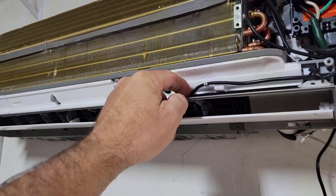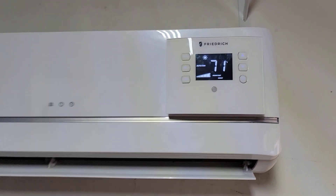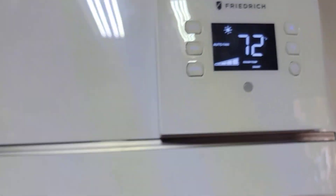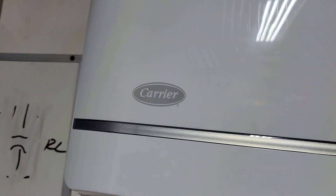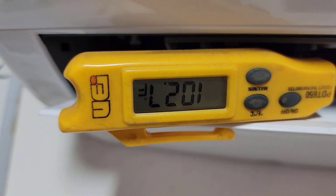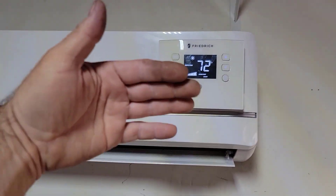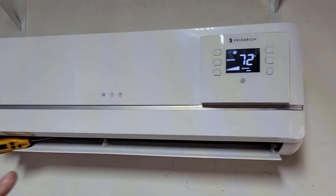I had to drill a hole and add this connector, so I'm not sure about the connection — I'm going to plug it back in and make sure it reads okay. It actually kicked on heat. It's about 103 degrees coming out of the discharge, and it's already heated the space from 68 up to 72 pretty quickly — about a 30 degree temp rise right now. That's pretty sweet.